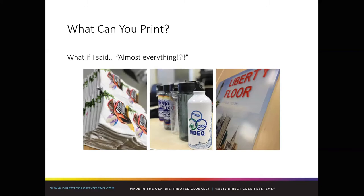Things we wouldn't recommend would be a silicone-based product — UV ink won't stick to silicone. We also wouldn't recommend printing to a mirror, as it can cause light reflection or refraction back up into the printhead, causing damage. On our systems you wouldn't print a coffee mug, but there are plenty of drinkware options — flat-walled bottles, double-walled bottles, tapered pint glasses, Yeti mugs — so it literally is almost everything.